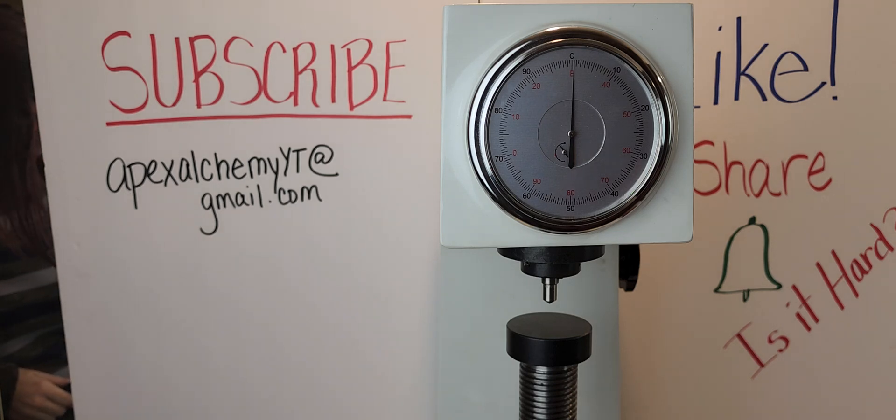I'm not saying Big Brown Bear is wrong — the average is right at it. With five pokes on this knife, the average is 59.55 and our first poke was 59.5, so not off by much. But we did see a variance of numbers: if we had taken just one reading and it happened to be 60 or 58, we'd have been off. There's a three-point variance from 58 to 61. He's definitely not wrong — we see the value in the average, but in this instance we got lucky.